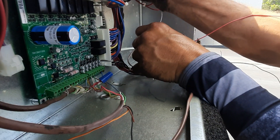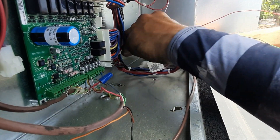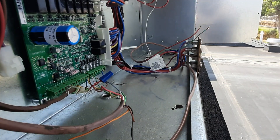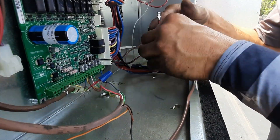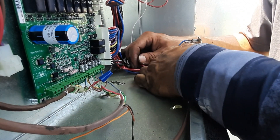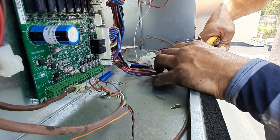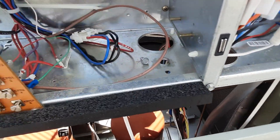We've got a common block right here so I'm going to tap into that to power our smoke detector. Red — these are 24 volts — is going to be one side of our e-stop. Green is our alarm contact, and that's going to be the outgoing side of our e-stop to power our control.